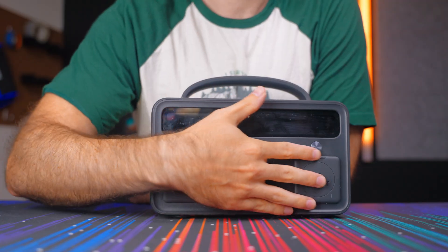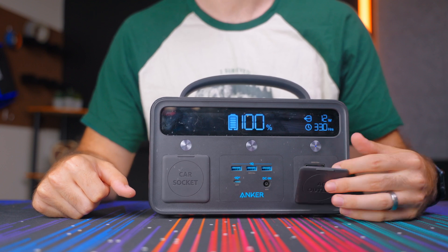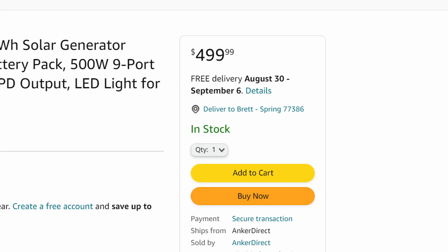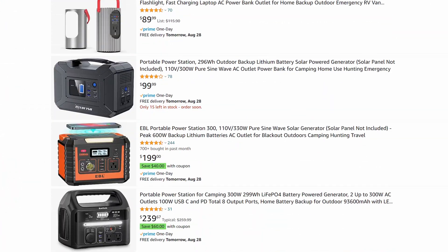We need to power these things, so I'm going with an Anker 533 power station. This is an old model — they now have the newer 535, which is 500 watts, 512 watt-hours, and costs $500. You can maybe get by with something smaller, both physically and power-wise; it's 100% dependent on your use case. With this one, if my lab uses 50 watts, theoretically I could get 10 hours out of it without needing to head back to civilization to juice back up.